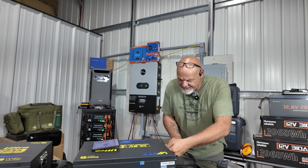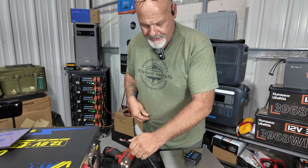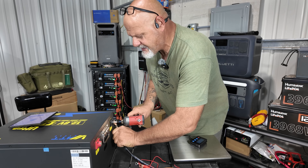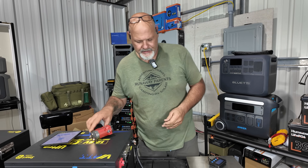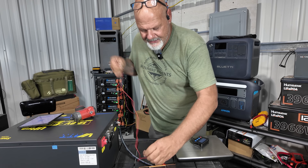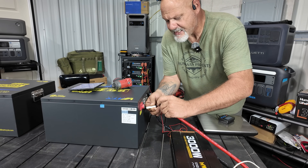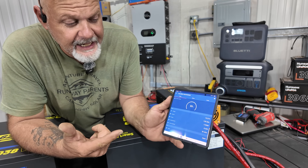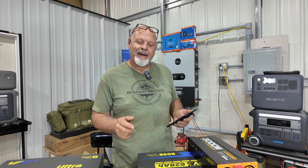We've got a 3,000 watt inverter set up on a Victron shunt. We're going to pull at a 0.2C rate, which on this battery equates to around 1,500 watts, and we're going to run it until it's dead — that'll give us our capacity. Touching the resistor to charge up the capacitors on the inverter first, and we're pulling 129 amps at 1,705–1,708 watts, which is just a little above 0.2C. We'll let this test run and see what capacity we get.